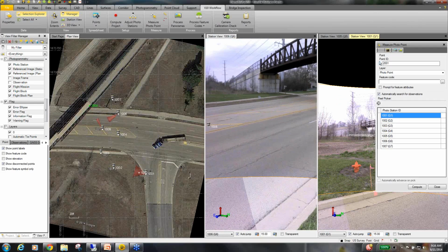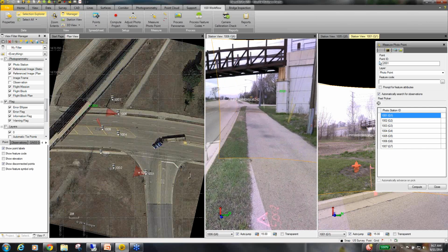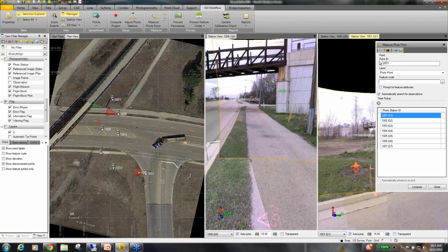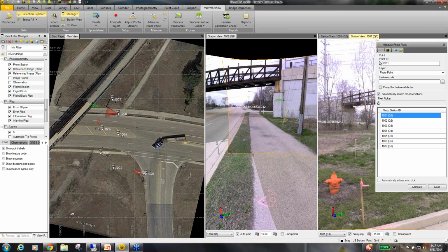And it also would probably save some time as far as the field procedures go, possibly locating more than what is needed. You know, if a drafter can look at this and go, okay, all I need is the endpoints, maybe one on the bridge up here, or if I'm locating this curb line, I just need my PCs and PTs and maybe the intersections. So it's a huge time saver in the field, and I think having these photos for the guys in the office is definitely beneficial to see what the site looks like. And also with Google Earth nowadays, we can view this kind of stuff.